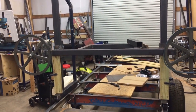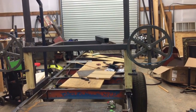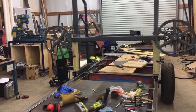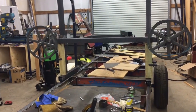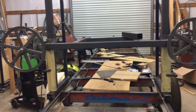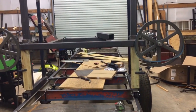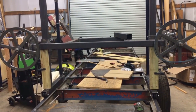Regarding the width, I did of course make that a four foot. What I did was went to a salvage place we've got near us and found some C-channel in scrap. It was probably about three inches longer than what you see right there, at least the blue pieces. So I cut it down to where the finished width of the trailer was going to be around the four foot mark, and just built it out from there.